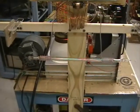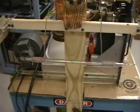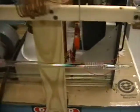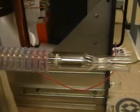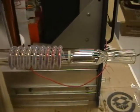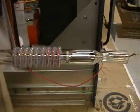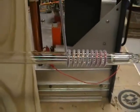In order to provide drive for the tube, a relatively high RF voltage must be supplied if you are going to drive the tube using coils wrapped around the tube as shown here. There is no electrical connection made to the internal electrodes of the tube. The internal electrodes cannot withstand sufficient power to drive the tube at a high power level. Therefore, capacitive coupling must be used.